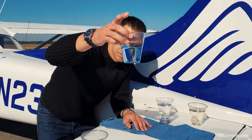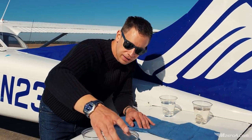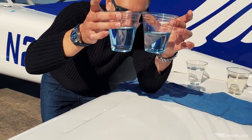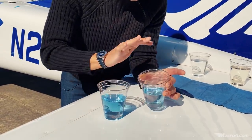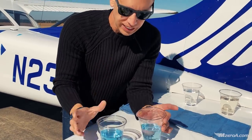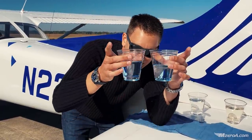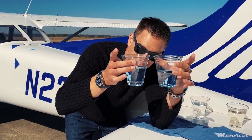What happens? Absolutely nothing — other than, hold it up next to the good 100 low lead, the tiniest little color change. The camera's not going to catch it, but on top there's just the tiniest little film that looks like an oil slick. The only way you're going to be able to tell the difference if you've got 100 low lead and Jet-A combined is the slightest color change in blue.